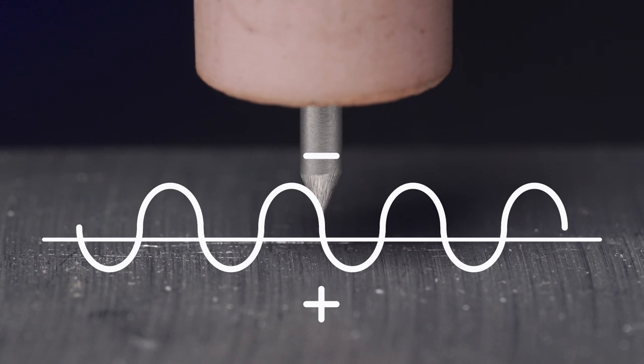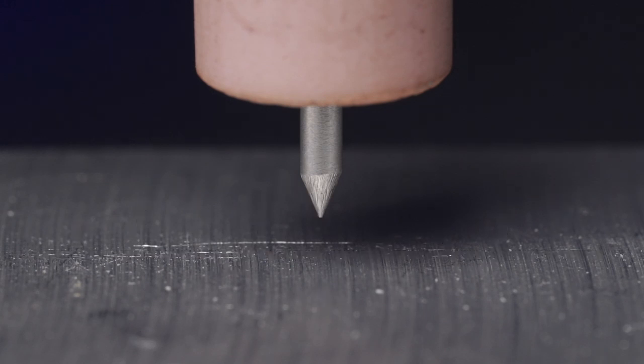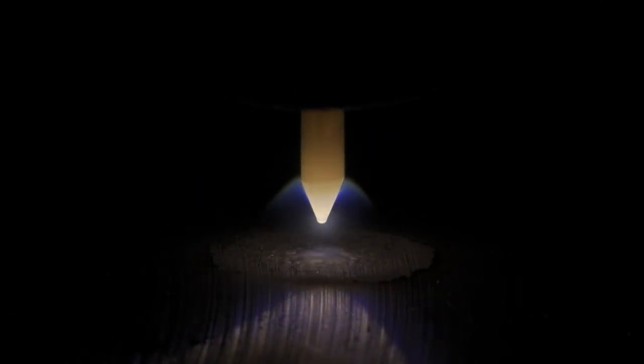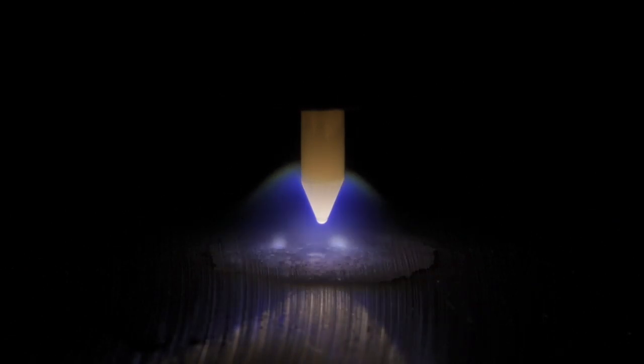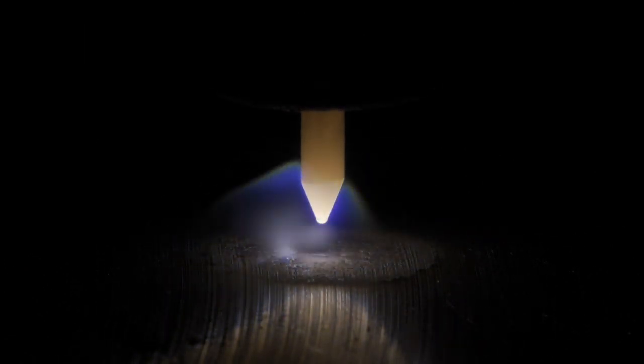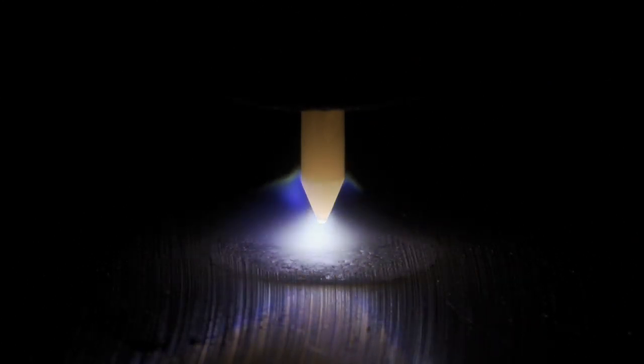We are starting all the way on penetration, as far as my welder will go to the penetration cycle. Right now we're starting off all the way to penetration, which on this welder is probably about 70 percent AC negative and 30 percent positive on the cycle — that's just an estimate, but it is as far as it can go on my machine.